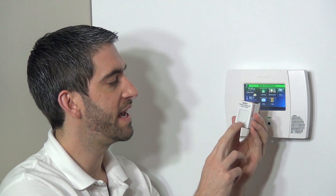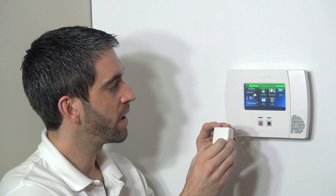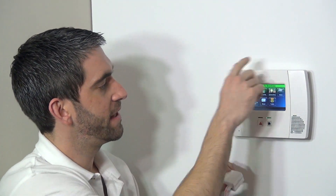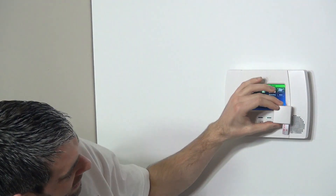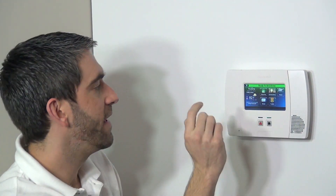With the shock sensor, what it's actually detecting is vibrations. So this device mounts directly to a window pane. You typically would mount it — let's say this is our window pane — you would mount it an inch from the side and the bottom corner, and then if someone's banging on the glass to break it, you're detecting the alarm even before the glass breaks, just on the vibration of someone trying to enter the property.